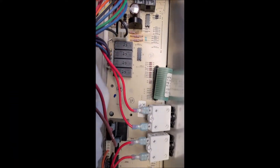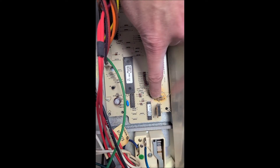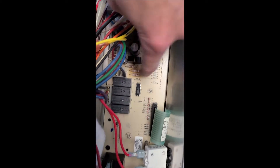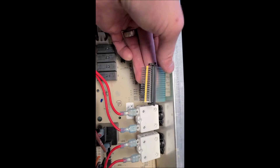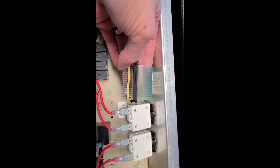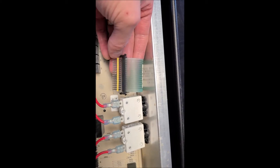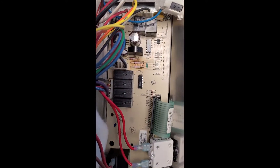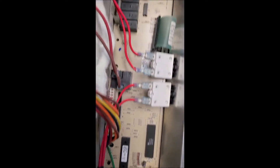Just doing a visual inspection of the board. I see some burning around this resistor here, some burning around the resistors here on the board. I'm just gonna pull this ribbon cable out. A little bit of corrosion on these contacts here, so the first thing I'm gonna do is just clean up the contacts on this ribbon cable. If that doesn't help, I might have to take this board out and inspect these resistors and that diode — make sure those are all still good.